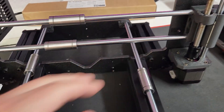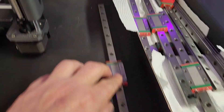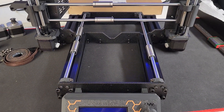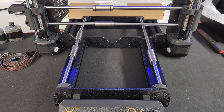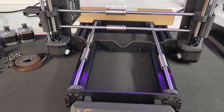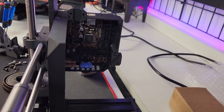I notice the linear rods are noisy. There's a simple upgrade where you can just run linear rails - listen to that, these are cheap linear rails and they're beautiful. I may end up putting a couple of those on. For the bed, I thought I could convert the Anycubic one over, but I'd rather keep the full Prusa size - these get up to 245 or 255 or something, and the Anycubic is only about 230. The motherboard is supposed to be a genuine Prusa board - I got that for 50 bucks.